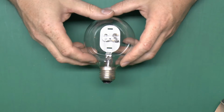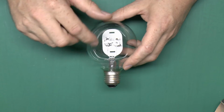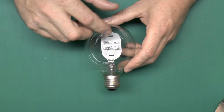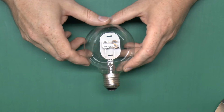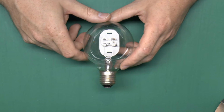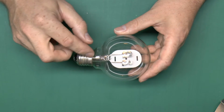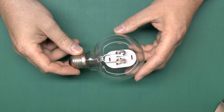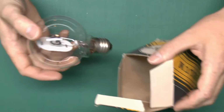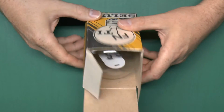that flows through, as these types of things in the non-illuminated state, they don't really conduct any electricity at all. When the gas actually strikes or starts conducting, you get that glow inside, then without any current limiting, the current would flow and will actually destroy the thing. Now most of these will have the resistor in, but I believe there are a few types or older ones out there which do not, so if you do get hold of any of these, don't just bang them directly into a mains socket, because you could end up actually destroying them.